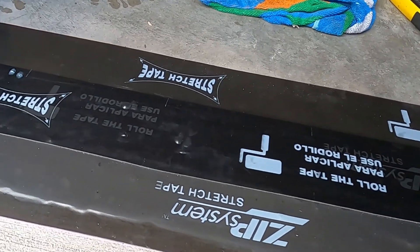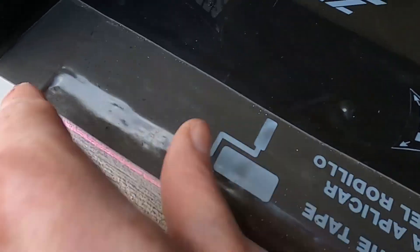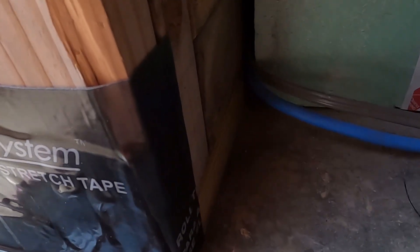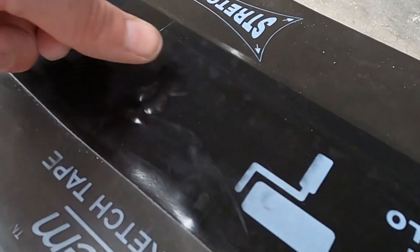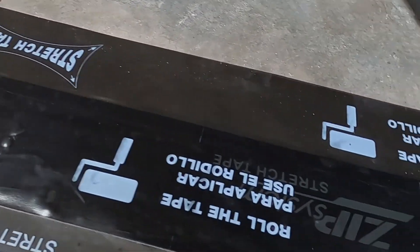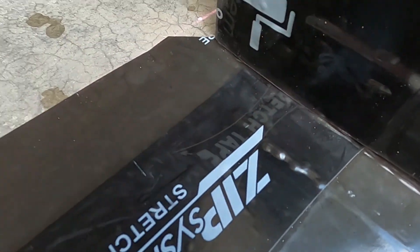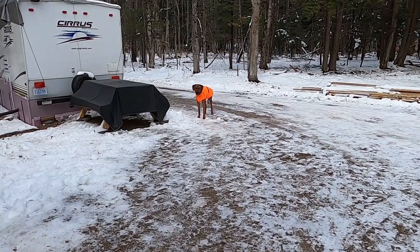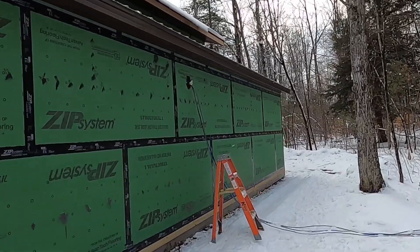This turned out pretty well. Just like before, we flashed two layers — one in front, one in back — and then wrapped around the jamb, trimming it off. It all stuck pretty nicely to the concrete. The edge is really close to the polyurethane and that should be fine. It seems to have sealed up very nicely around the metal flashing and I'm pretty pleased. It goes all the way around to the other side and creates a pretty nice barrier. I did this one without Robert's help and I did trap some air bubbles — I don't think that's a problem since it'll all be covered with a sill plate. Another set of hands is nice when you're putting two layers of this airtight stuff on top of each other — it sticks to itself so tenaciously.